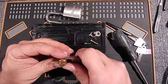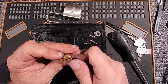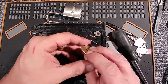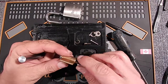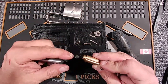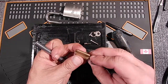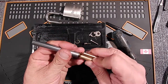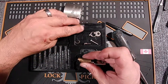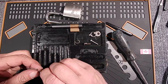Let's get my little clip remover here. What I do is move the bottom of the clip to sit in there, then push the top over and she just comes out very nicely. Now I need the key and a follower. I move the key to about 90 degrees — have to go the other way so I don't drop the driver pins up top. There are five pins here on a six-pin core. Let's get them out and see what we have.